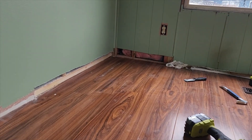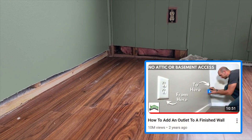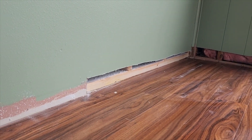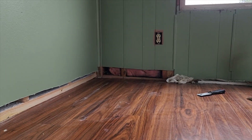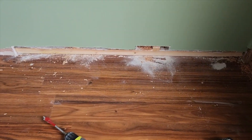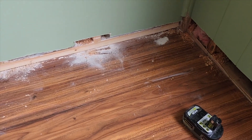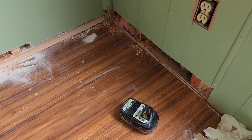My friend Scott from Everyday Home Repairs has a great tutorial video on how to extend a plug. What I've done is remove about the bottom three inches of the drywall and paneling, and I'm going to drill holes through each of the studs until I get over into this bay right here. Then I'll put an outlet in the wall here and up above for the television — it's just a matter of drilling through the studs, pulling that box out, and tying into that electrical. My first mistake was not going up high enough. I have a three and a half inch baseboard and I could have gone to three or three and a quarter inches, but I went too conservative at about two inches and that bit me in the corner.